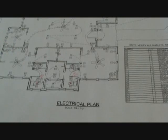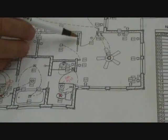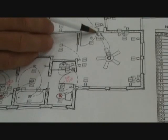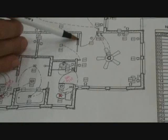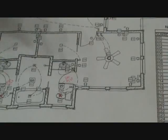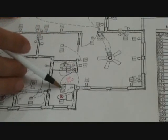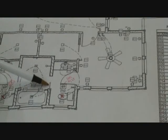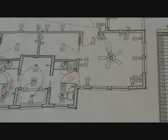Let's take a little closer look at this room right here. You see this curve and this line — that means that's a door. The door swings into the room, and here's the door right up against the wall. Then there's a closet right here. See how this line goes into the wall? That's a pocket door — it doesn't swing; it slides into the wall. And over here, here's another door that curves as it opens, so you walk into the room. Here's the next door opening, and there's another pocket door. So everything kind of has its place, and once you understand that, you have an idea of where to go next.